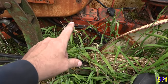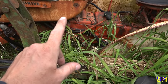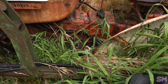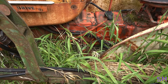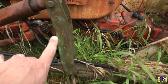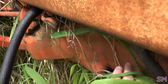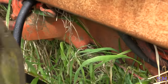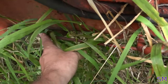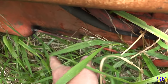What I'm going to do is work on the clutch, figure out why I wasn't going forward and backwards. Now, for you guys that might be following along, for the one person that might still be following along, bless you, these tractors have two clutches. Number one, you have your traditional dry clutch bolted up to your flywheel like any standard old school car. It's nothing terribly fancy. This goes to your foot control. If I can get grass out of here. So that's your dry clutch.